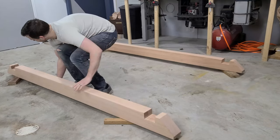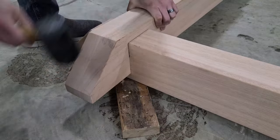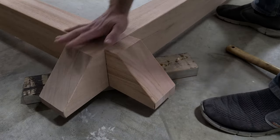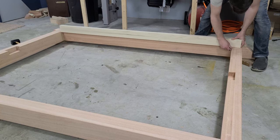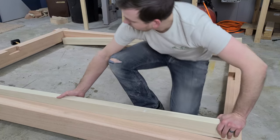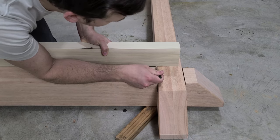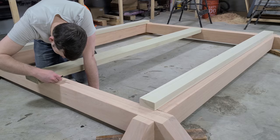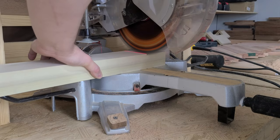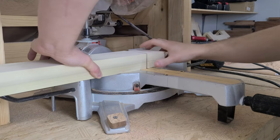The final cuts we have to make for this hanging bed are the platform supports and their slats. Before we cut them to length though, we first dry fit the 4x6 timbers together. These joints aren't as tight as I would want for a glue-up, but they are perfect for a piece that will get assembled after finishing and will need to be disassembled if we ever move. Once the timbers are all together, we bring the platform support boards over to the bed frame and mark their length. We'll cut these about an eighth of an inch short, just to give us a little play during assembly. Once the supports are in, we can also check the fit of the platform slats. These slats will curve to meet the support boards, so the fit is a little more difficult to gauge. You can press a board into place, mark it, and adjust its length until it drops into place — and once you've dialed in the length for one, it's easy to adjust the lengths for all the other boards.